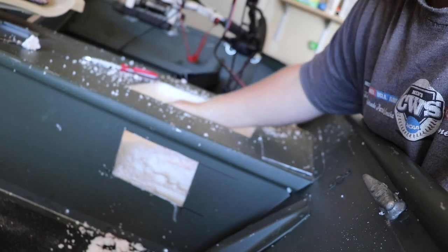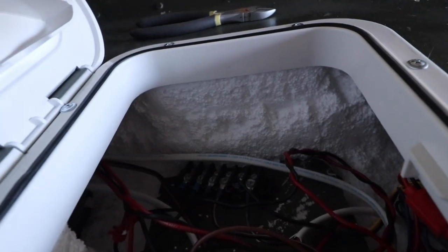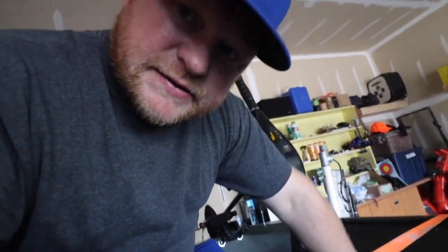The hardest part was getting all the styrofoam out of the hole. There's styrofoam in there, so I had to cut it out — just what I needed — and then cut a little hole to the back where I ran the wires through. I used some rubber grommets in the back so I wouldn't damage the wires. I put in a waterproof box and I'll put a link to it in the description — it's fairly inexpensive. I put some caulking around it as well, so it should be watertight. The switch I put in is also supposed to be waterproof — it has a little rubber gasket.